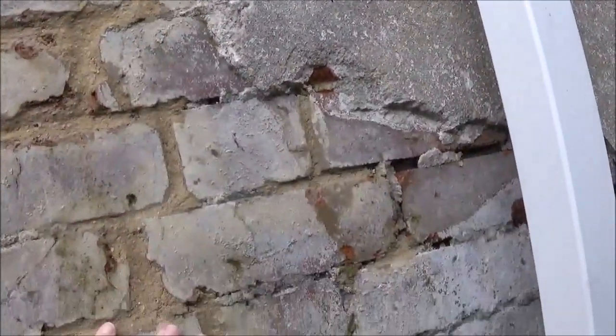And where you have the final outfall into your soil pipe, you've got this hole. Now they come with a piece of plastic in them and you need to cut this out. The easiest way to do this is with a hole saw — for this I'm going to use an 86mm hole saw, and that appears to be the perfect size to do this. That's more or less done the trick. I'll need to cut and file a few bits out and smooth it off. So once you've drilled your hole in your guttering and you connect it up, you need to line your gully pot for your soil pipe directly underneath, and this drops inside that. You can apply a bit of sealant to that if you want to seal it up. Then, using this universal joint, I'm manoeuvring that around, and I'm going to put a piece of pipe up inside this. That's going to go directly down here. So I need to mark roughly where I need to make my hole — I'm going to do that with a pencil. Then once I've marked my circle, I need to start to grind it out with an angle grinder.